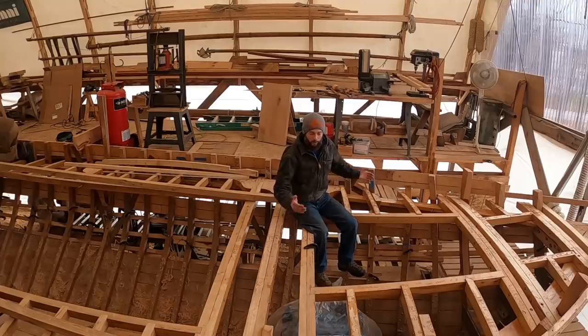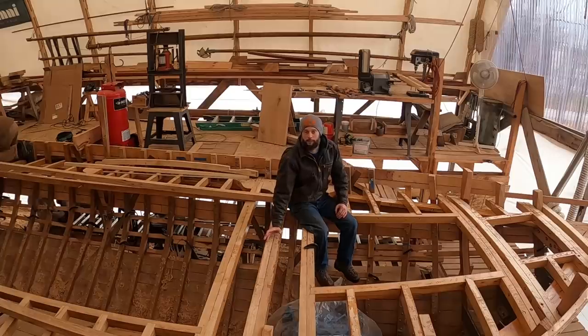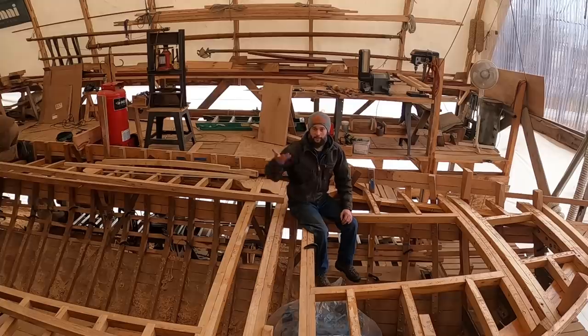So Atkin had this huge cockpit drawn in that was basically the whole width of the boat, and it had fuel tanks underneath seats that were in the cockpit. And the mizzen mast came through here through the bridge deck, and the bottom of it landed on this huge beam that ran the full length underneath the cockpit, so it went all the way to the stern and was supported up by the engine. So that's what carried that mizzen mast, and you had this huge cockpit.